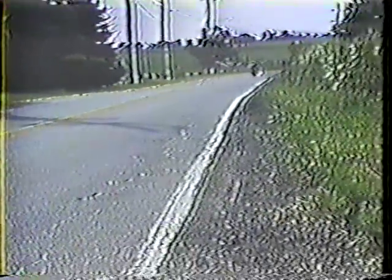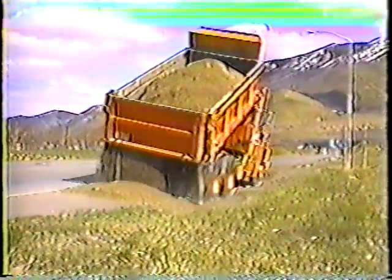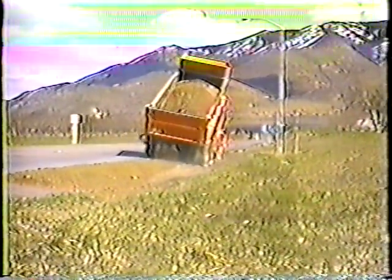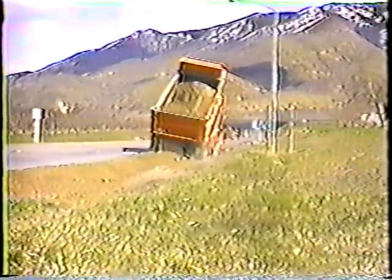One of the best ways to prevent these problems is to follow the procedures outlined in the maintenance handbook under edge rot repair and grading gravel shoulders. Depending on the condition of the shoulder, this activity can require as many as 10 steps. But before we go too far, let's look first at a properly constructed shoulder.